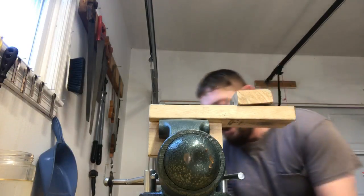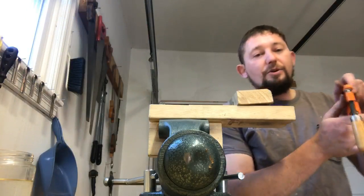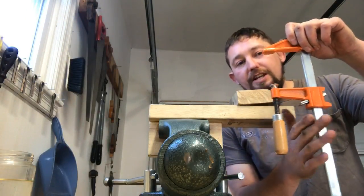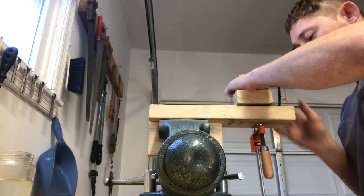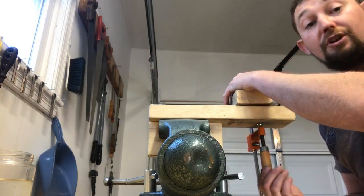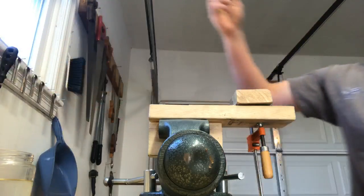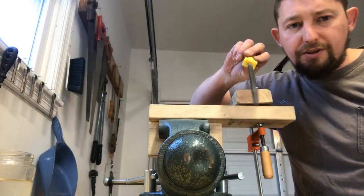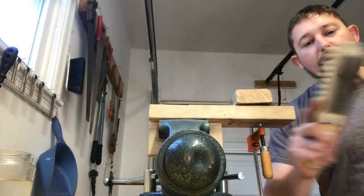Oh, there it is. After I set up the new shop, I don't know quite where everything's at, because I kind of reorganized it. I use these style of clamps here. They're easy to adjust. Now, don't put extra pressure on the harp. If you start doing that, you'll start warping your frame in the other dimension, and that's something you don't want to do. I'm just using a coarse four square file, got it at Harbor Freight. You'll probably see me doing this several times.